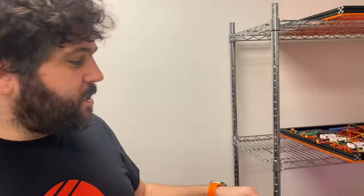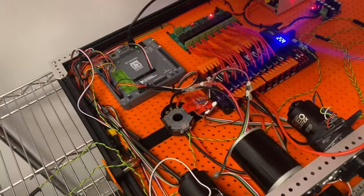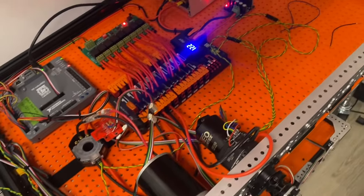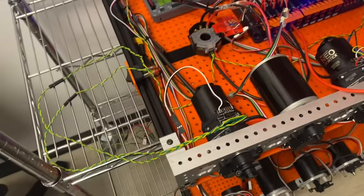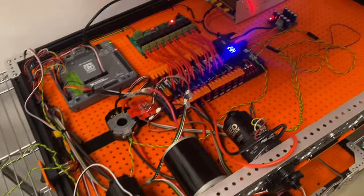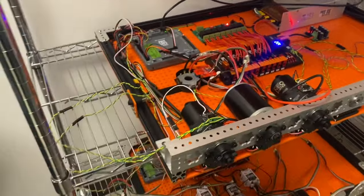So we build a bunch of testers to test products, and so when we're doing firmware development on motors and motor controllers that we manufacture, this is a networked device. When they deploy new firmware, it'll fire off a tester that will run through all the software. So as our software people are working on stuff, literally every time we try to push code, these will start spinning and then they'll do reports. So it's a hardware-in-the-loop tester for all the capabilities that we have in our devices.